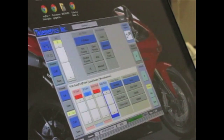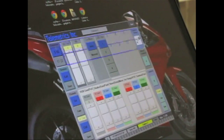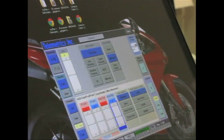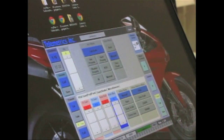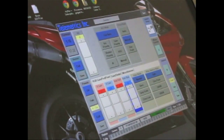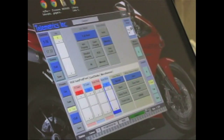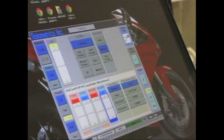As I switch cameras, this light down here will turn from red — if it doesn't see any camera — to green once it gets feedback from the camera. As long as this is green, we know we are sending and receiving data from that camera. This also tells you the pan-tilt type (PTHP compact) and the camera type (HDSC). The AUX axis status would also appear here. And this is the version number — revision 1.124.